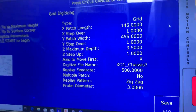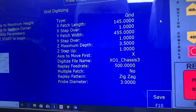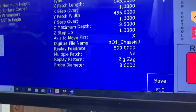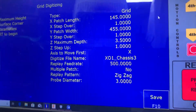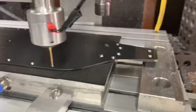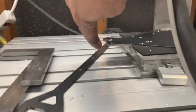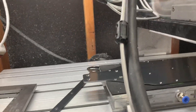I don't see any reason to go less than one millimeter — I think that's excessive resolution and it just draws out the scan time. In this case I have my Y width at 455, starting about three millimeters on one side and ending about three millimeters on the other side, so it will do some open-air scanning, which is okay.